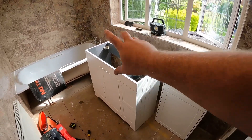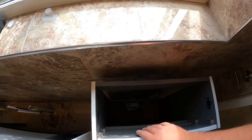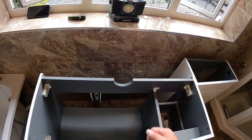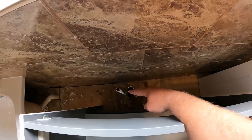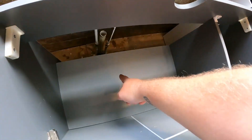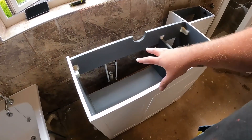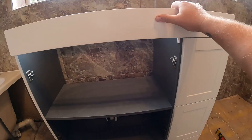I've offered in the two units — the basin and the toilet. With the soil pipe coming out there, we're going to have the toilet unit there. The basin unit is going to edge ever so slightly against there and push right back. We've got the pipes coming out the floor with a trimmer and joist there — I don't want to disturb that too much, so we're going to come through the bottom of the unit internally. All you'll have coming through there is the two pipes, the waste pipe, and we'll put some chrome caps on there just to finish it off within the unit. Let's get this out of the way and work out exactly how we're going to bring these pipes through the bottom and get them bolted back to the wall.